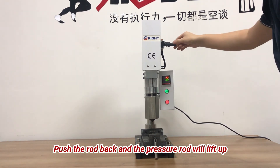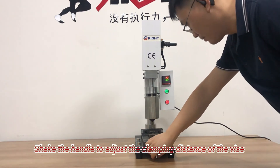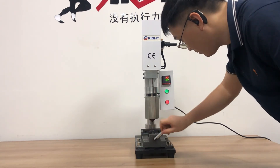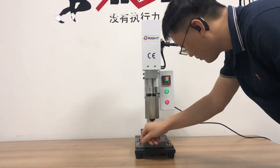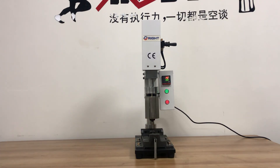Wright Instrument Company offers a great, no-frills injection molding machine. Based on a simple manual or pneumatic press, this machine has a shot volume of 20 cubic centimeters, or 20 grams. With a simple vise to hold your mold, the machine can accommodate a maximum mold size of 120 x 120 x 80 millimeters.